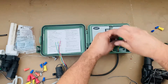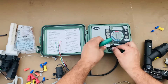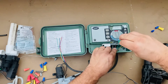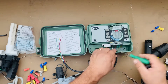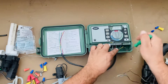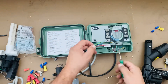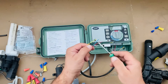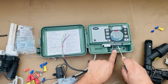I'm going to use red for zone one and green for zone two. The actual color code doesn't matter — it's whatever you choose — however you want to stick to something you will remember, or take a photo of it. The colors just represent the zone number you are using in the system, so that you know when you get to the other end of the line which wire is which. That's the reason they're color coded.